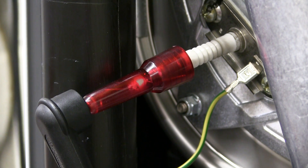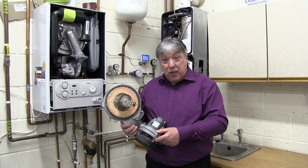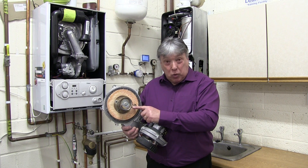I can see the LED glowing, so therefore the boiler has tested the pump, the fan, all the sensors, the pressure and the stats, and also finally the ignition system — all are working perfectly. We now know the fault has to be the gas valve or the spark igniters, the electrodes.